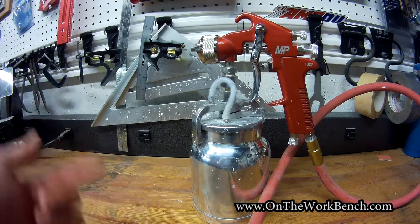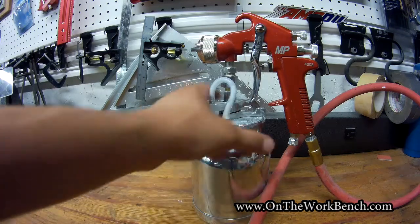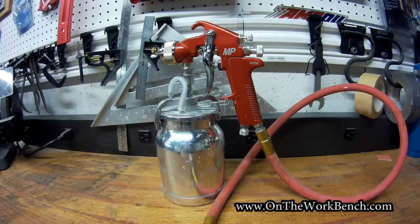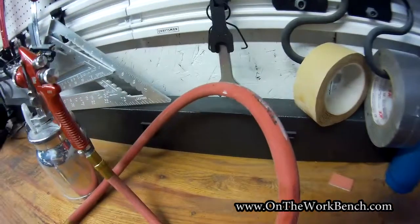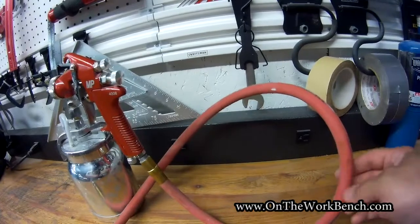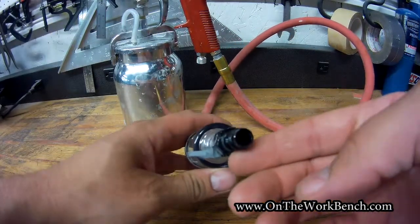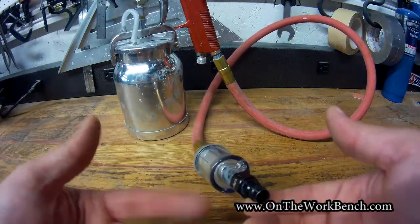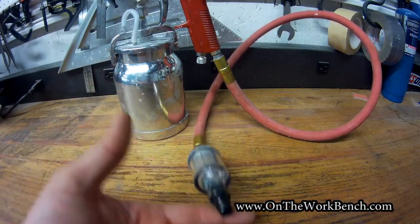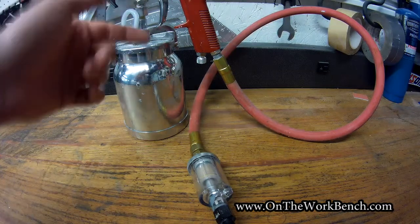Not sponsored by this. If you're interested, I'll put a link in the description below — it's on Amazon, and that is an affiliate link that helps support the channel. The whip hose has worked well and gives me extra length. It's clean — not greasy like the rest of my air hose line, so I'm not contaminating projects with grease or dirt. I'd encourage you to do the same: use a dedicated clean whip hose with an oil and water dryer. I've been using this with high-flow fittings, which I think helps maximize airflow capacity through the gun.